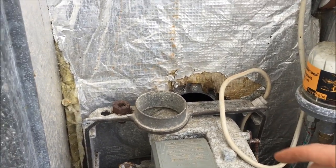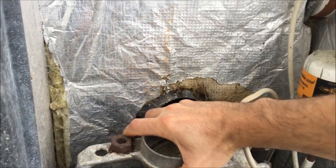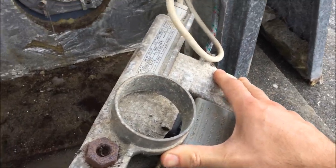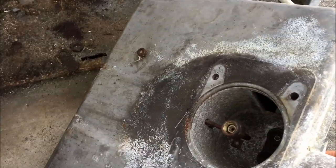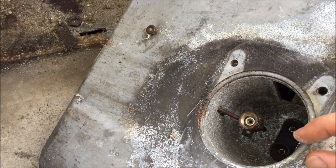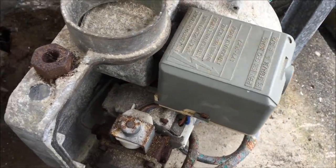So where did I start today? I took off this nut here to get this whole unit off — it's only held on with one nut, and it should have a cover but that aluminium shroud isn't fitted for some reason. If I tilt this back gently, that's where the oil shoots under pressure into the jet, and those two things on the back are springs where the electrode joins up with the HT coil, which I presume is in that grey box there.